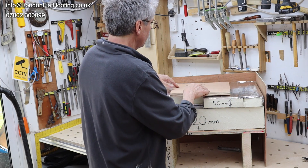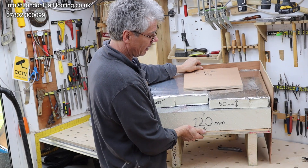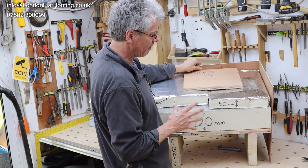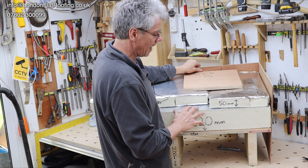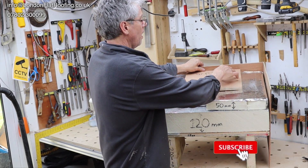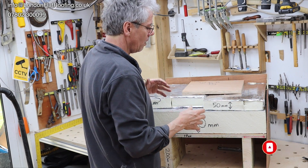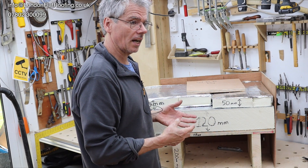When you put your decking on top, remember the fall of the roof is in this direction. I've been reading that in America they've had loads of roofs fail — although there's no ventilation in these roofs whatsoever, air gets through the joints, accumulates because hot air rises at the back, and the roofs are rotting.